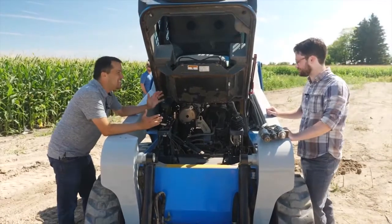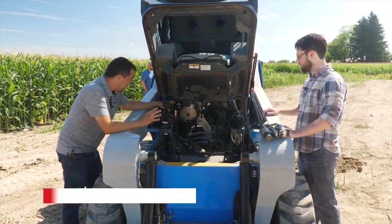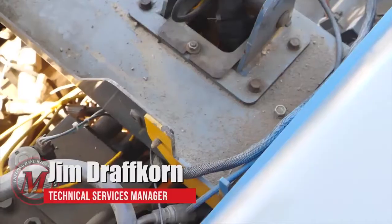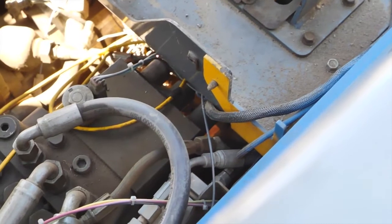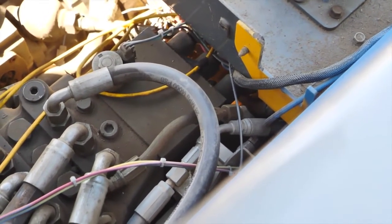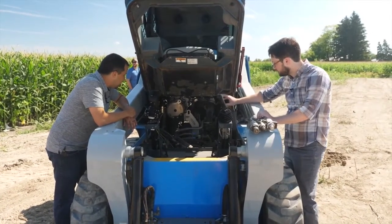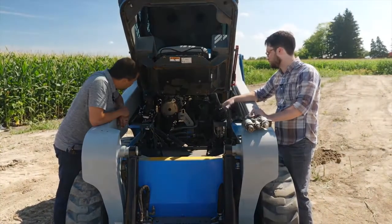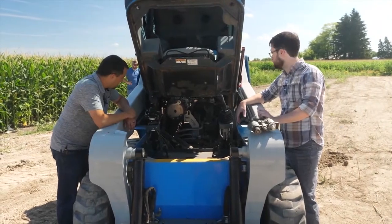So this machine is one of a kind here, right? Talk me through some of the things you guys have changed underneath the cab here. The main thing we have done is we took out the main control valve and replaced it with a Rocat monoblock with our own control valves going on either side of it to control the spools. We swapped out the ride control for our newer ride control that we've been advertising, and the self-level we changed from hydraulic self-level to electronic sensors. And then the monoblock itself actually controls the level of the bucket to the level of the lift.